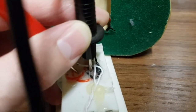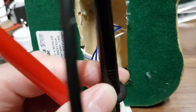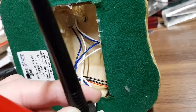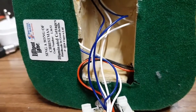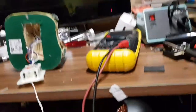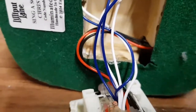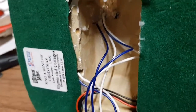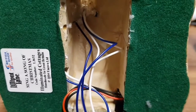Why would you have voltage across these and they're not lighting? Two volts should be enough to illuminate an LED. I'm a little bit confused because voltage across an LED should make it light. It's drawing current - currently 11 milliamps. You'd have thought 11 milliamps through three LEDs in parallel would cause them to at least glow a little bit. Simple but confusing.